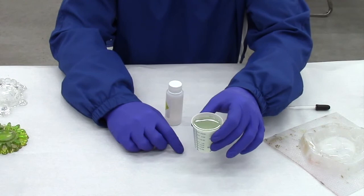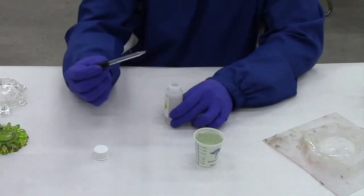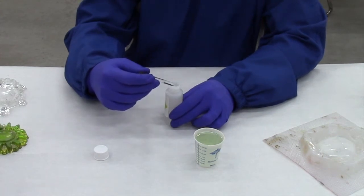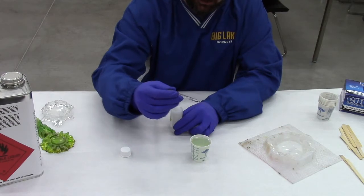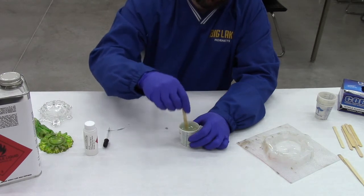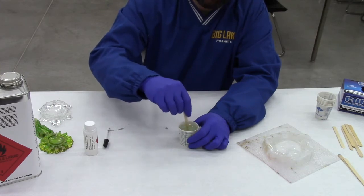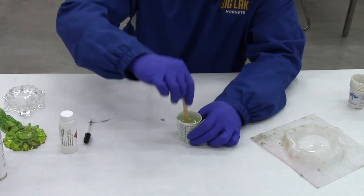You can see the material is a little bit thicker. I don't want to get this into my eyes. I'm going to take my eyedropper and suction up some methyl ethyl ketone peroxide. The rule of thumb is 10 drops per ounce. I have three ounces, so I'm going to do 30 drops — counting up to 30. With my stir stick, I'm going to make sure I stir the catalyst through the full column of resin, from top to bottom. People ask if this is enough stirring — if you do more, it's not a problem. My catalyst has now been fully mixed into my polyester casting resin.